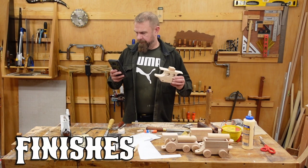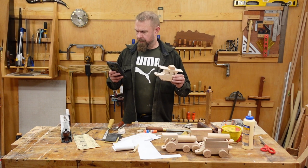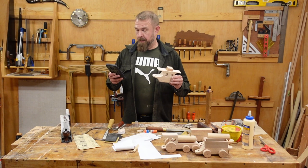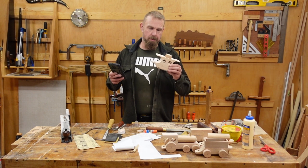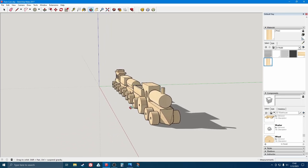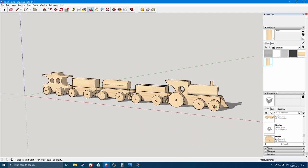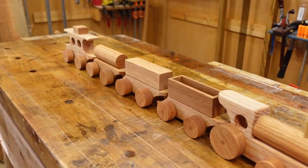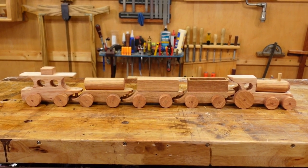And finally we get to finishes. This toy will most likely see hard use. I recommend against polyurethane and other film finishes which could potentially chip off. The safest option would be mineral oil or another cutting board finish — these are food safe and won't pose any ingestion risk. Boiled linseed oil or teak oils without harsh metallic dryers may also be acceptable. I need to make a note to wipe all the excess off the spoked end of the wheels so you don't get gooey crud in all the little crevices. I actually ended up changing my instructions so the finish is applied before the wheels — I didn't want anybody having the frustration of trying to get underneath there. Please let me know in the comments if this was of value. Thanks for watching.